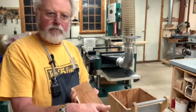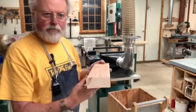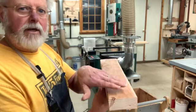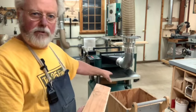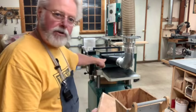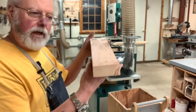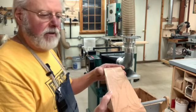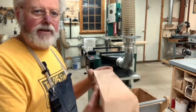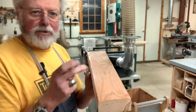It can, provided that a flat surface is put on the infeed side of that table, draw a piece of lumber through and make the upper surface parallel to the surface that's on the table. Which means if there is warp and twist in that board that goes into the planer, it will plane the board more than likely. But when it comes out, it will have the same twist and the same warp in it that it did when it went in.